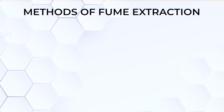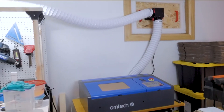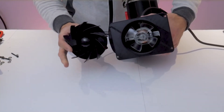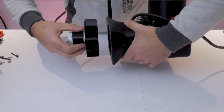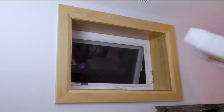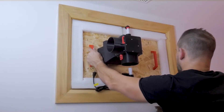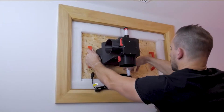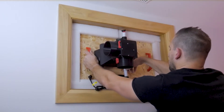The first option was evacuation and relocation — moving fumes from my basement to the outside. This was my original approach with the K40 and resin printers, using inline duct booster fans that move large volumes of air but don't generate much pressure. It worked adequately during warmer months, but in a cold climate like Canada, the pressure differential between outdoors and indoors couldn't be overcome by the fan. Everything I tried to vent outside simply got pushed back inside in winter. Plus, neighbors may not appreciate the smells wafting over.